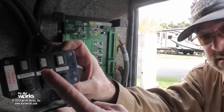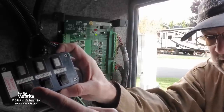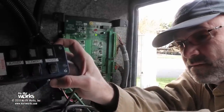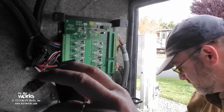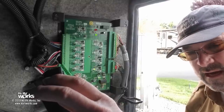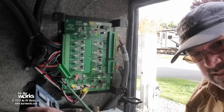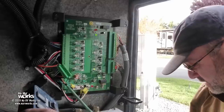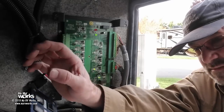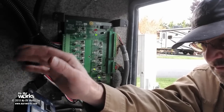After a few minutes this fault light is going to come on — same light that appears inside your coach — basically saying 'I tried, I couldn't light.' I've got my hand on the exhaust and it's just warm, certainly not hot. These things target 180 degrees. We don't have ignition. Sometimes you get a little smoke when they first fire off, and since the gas valve is engaging and spraying inside without igniting, we're going to have a lot of unburned fuel in there.